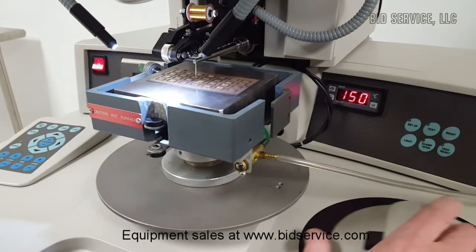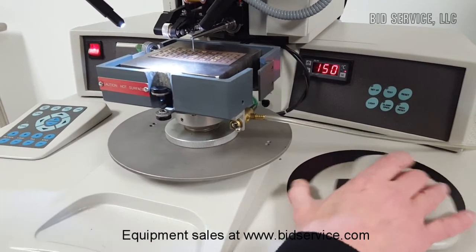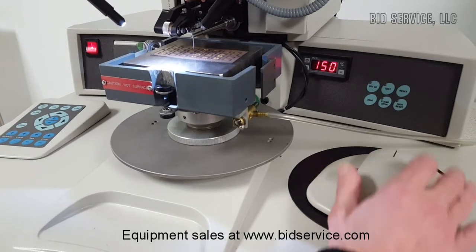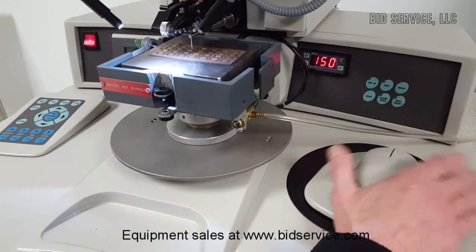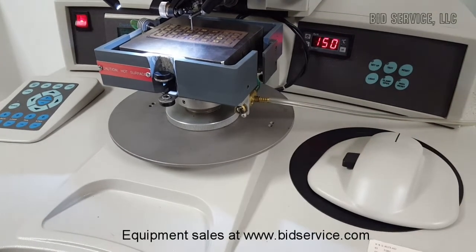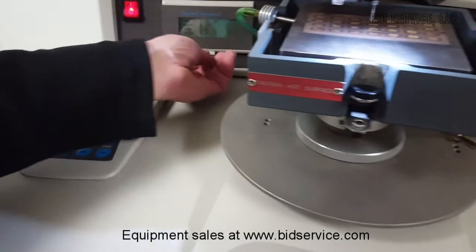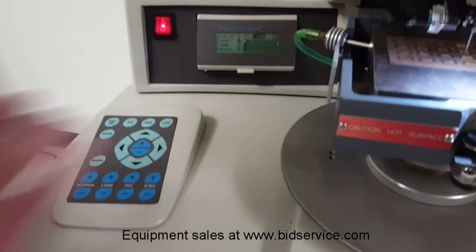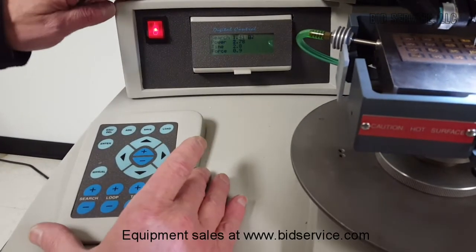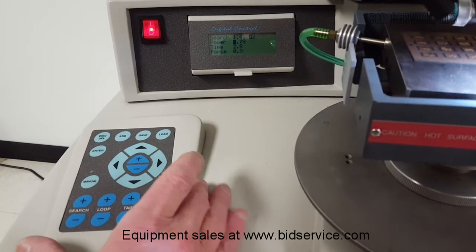There you have a Chessman pin that moves your work holder, which is on the stage. You have a stitch button, and on the left-hand side you have your semi-automatic button. Over to the left is where you program your programs. Right now we have the default program that loads up when the machine is powered up.